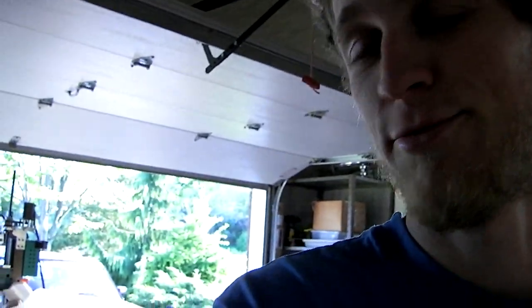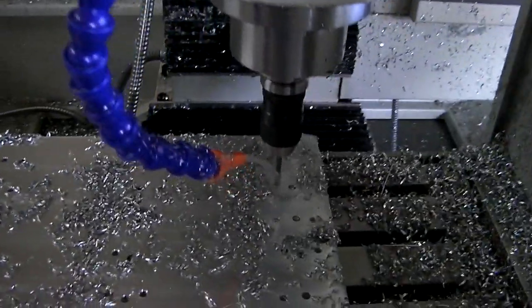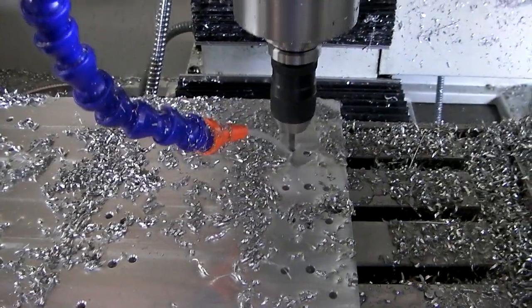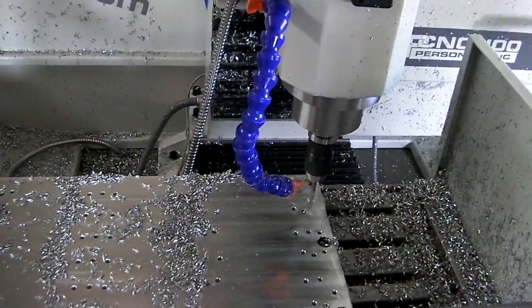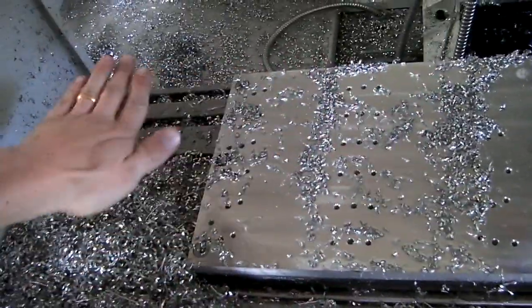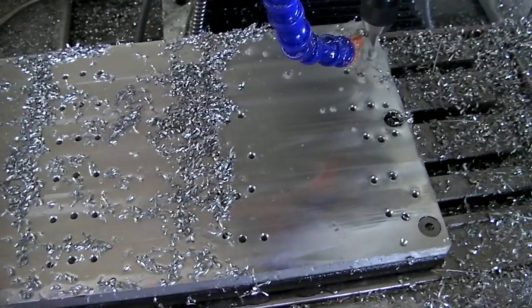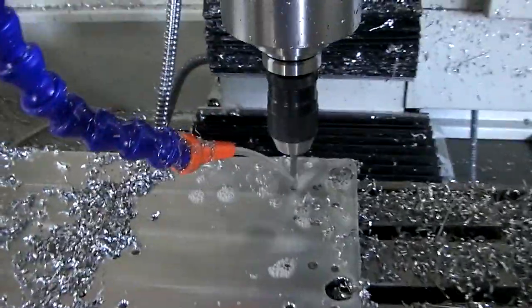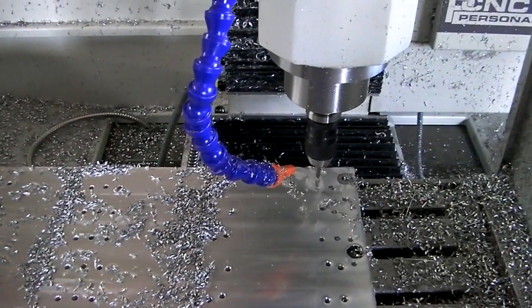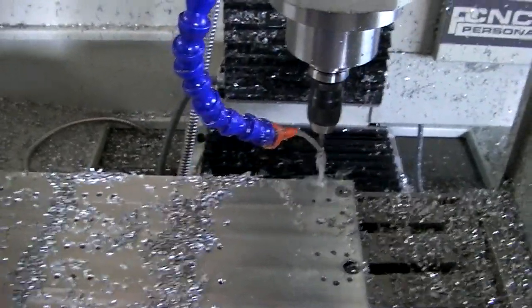In the tradition of not trying to be too boring, and just show my pretty face and Eric's face, let's check out this machine in action. Right now it's drilling a series of holes that pins are going to get pressed into. That's called peck drilling — where it goes in and out, it lets the chips come out and lets the coolant hit the end mill or the drill bit to keep it cool.